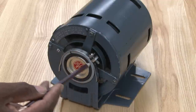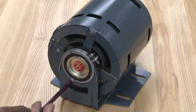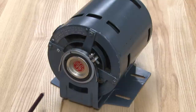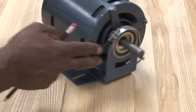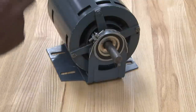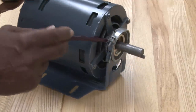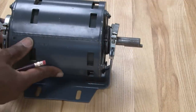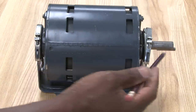The resilient rings actually make the motor very quiet because they absorb the vibration and noise from the motor before it sits into the cradle. So basically this rubber or resilient ring supports the motor but also insulates it from vibration and noise. The shaft goes all the way through and the motor has bearings on the inside, mounted in the end bells that hold it together.